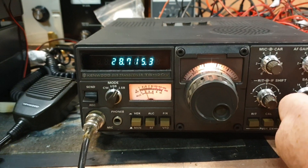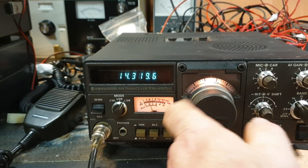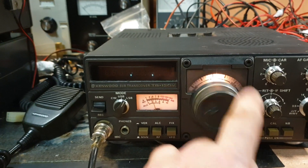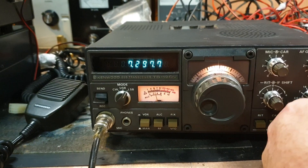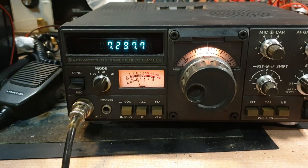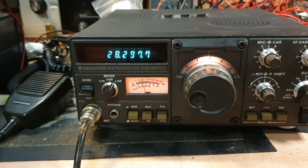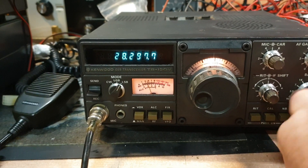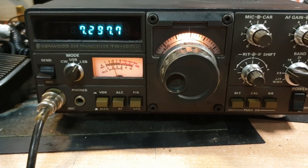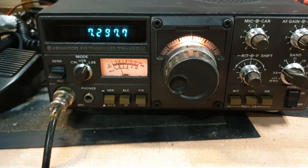So we've got a second reason to go back into this one. Just remember: if 21 MHz is dead and you can't bring it back with the VCO, if it's out completely like it is right now, someone's done a 27 MHz mod to it. That can slip you up because the band still reads 28 MHz, so when you go around to 28 MHz you don't know it but you're actually one megahertz down from there. Just a trick for new players.